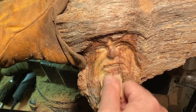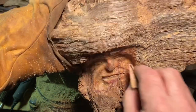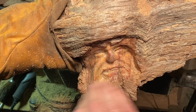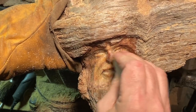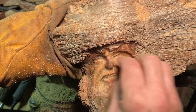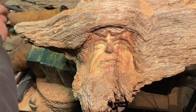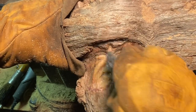Here I'm hitting the face with a little sandpaper every once in a while just to get the rough edges off. It gives you some idea of what the wood looks like when the finished product comes around. I usually finish off with some wire wool or steel wool at the very end, because the steel wool fits into a lot of crevices — it conforms to the shape of the face better than sandpaper. With sandpaper you have to fold it and do all kinds of stuff to fit it into the cracks, but steel wool you can push right in and it gets into all areas of the face.